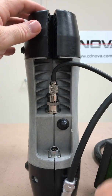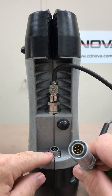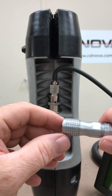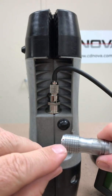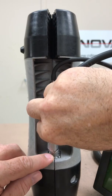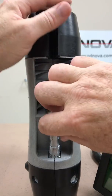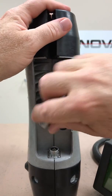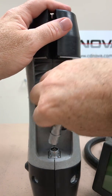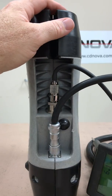The electrical connection has pins on here and it has to be lined up the right way before you push down on the electrical connector. The way you know it's lined up properly is there's a little red dot on the side of this connector. That red dot lines up with the little red dot on the connector on the TVA 2020. Once those two red dots are aligned, you simply push down and it snaps into place. To take it off, you grab both sides of the jack and pull up — it's a spring-loaded connector. To put it back on, line up the red dots and push back down.